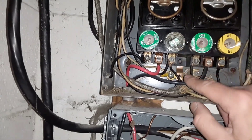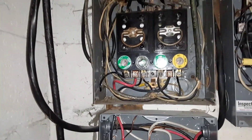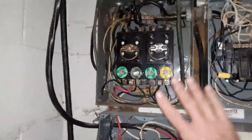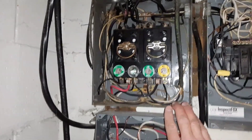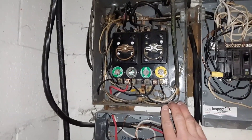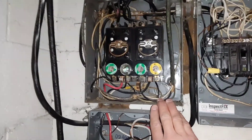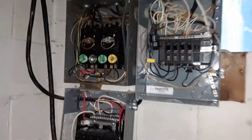This could potentially overheat and melt the wires. There are several multiple issues here — definitely recommend an electrical upgrade. These fuse panels are disappearing, which is a good thing. Now that people are asking for electric vehicles to be hooked up, this system definitely could not handle all of that electricity. Thanks for watching the video and don't forget to subscribe.